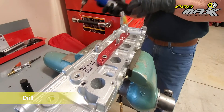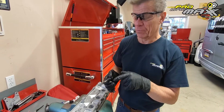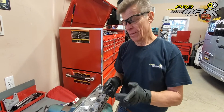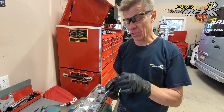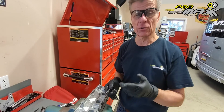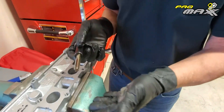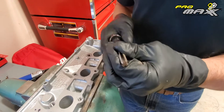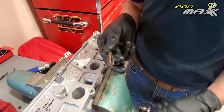It's that quick. We have the tools from Promax — machine tooling. The difference between a machine-grade tool and a regular tap or tool is that these are high-precision. They're designed so they cut really easily. The threads are very, very sharp, and they're going to cut true. This particular one's a bottom or plug tap. It allows us to get deeper into the threads, and you can see how nicely it cuts. We only use exclusive gold-style, machine-grade tooling taps in all of our kits.